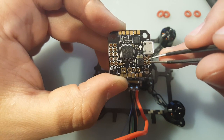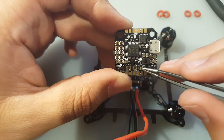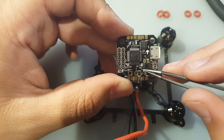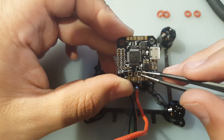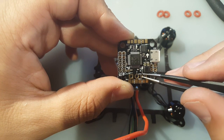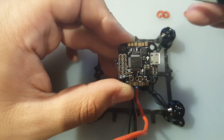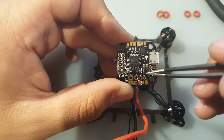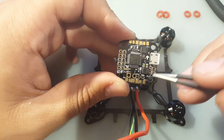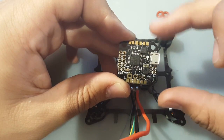And if you wanted to add LEDs, they would go right here. Sorry, transponder or LED, it works the same. VTX, with LC filter built in, so this is to the VTX, but I don't know how many volts it's bringing out, so I think I'm going to have to use a multimeter. I hope it's not a direct connection from the battery, because that'll just burn the all-in-one camera we're going to be using. We're going to be using the Eachine Tx01 or Tx02, I don't know yet, but we're going to have to check the VTX here. So that's basically it right now.